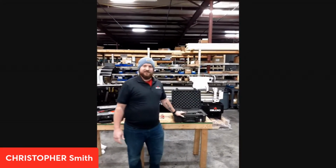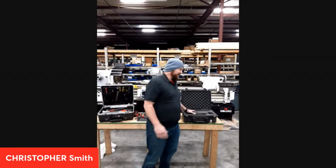But I always take my precision levels. You want to check the machine first. If something's not cutting right and they think it's the chuck, we always want to check the level first. So a set of machine levels, always checking that level. That's where you always want to start first. That could be one of the most common problems, with a crash, any kind of vibration, oblong parts that cause the machine to shake or chatter. A lot of that can be fixed with getting the machine level. So that's also what you would want to take with you. But the five most important are the first five that I talked about today. That's pretty much all I got for today, guys.